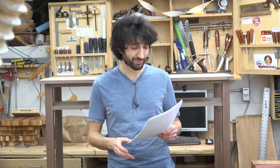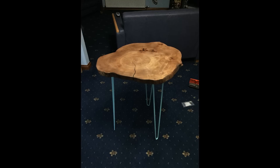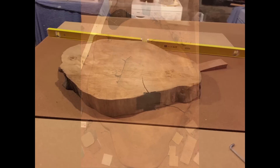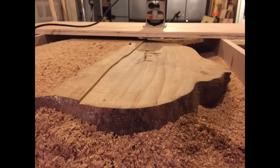This last project is also a table. It's from Chris. This is an end grain table — basically a cross section of a log, or what's called a cookie. He said this was originally going to be a piece of firewood. He filled the cracks with epoxy and then made a torsion table and a router flattening jig to flatten the whole slab. After a ton of sanding, he attached that slab to some metal legs and it looks awesome.